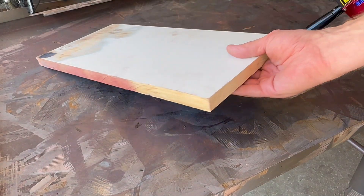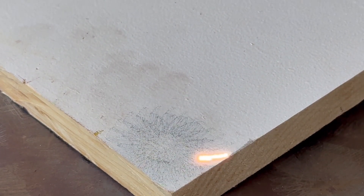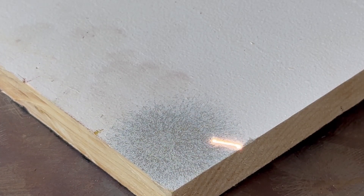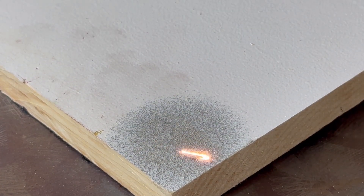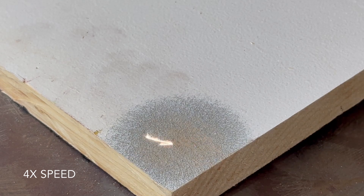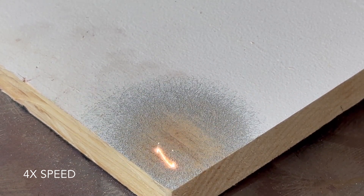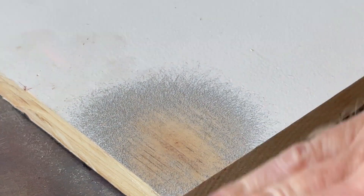The last test for the FL-C200 pulse laser was pure white latex paint — the number one coating that homeowners put over original woodwork and often regret later on. White surfaces are a challenge for lasers because white reflects the most light. When stripping automotive paint from metal parts, I found that white takes 2–4 times longer than a darker color, and you can see that white latex paint on wood also takes longer. But after some time, I did end up with a clean, unaltered, bare pine surface.